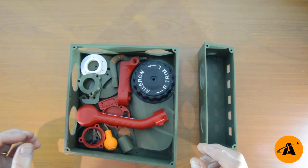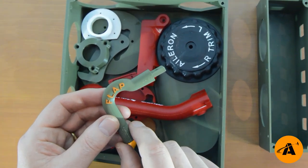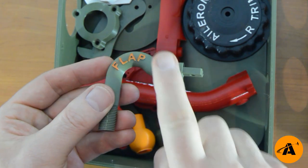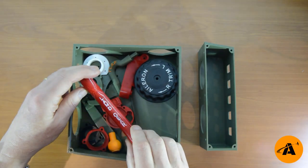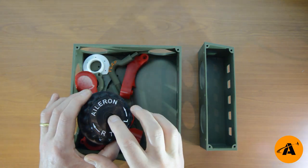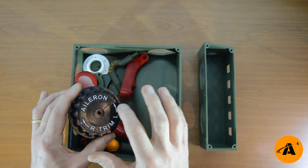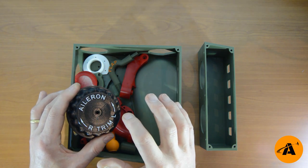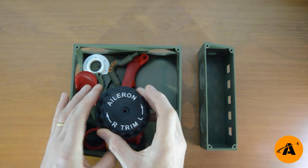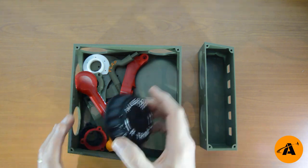I've also done a little bit of painting — I just got a little bit of acrylic paint and did a pretty messy job of dabbing it on. It's embossed, so you don't have to draw the whole thing out, you can just dab it on. I'll put a link in my description if you haven't seen it already — that's the white lettering video. This is indented — debossed is the right word — and that's white silicone that's been embedded. That's a pretty easy and really nice finish technique that you can do. Off the printer that's just solid black.